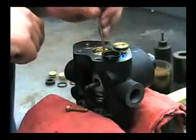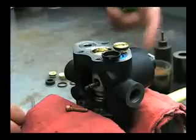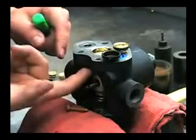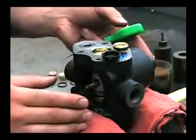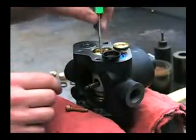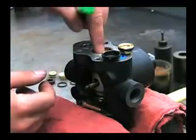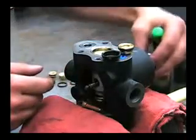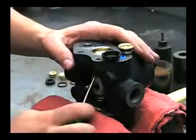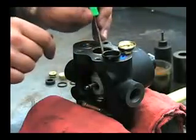If you have some difficulty getting this piece out, you can pull this grease fitting out, take this retaining ring off in front of the bearing, and push the whole bearing and shaft assembly out first. Then you'll have better access to be able to get in there and get that out. It is possible to replace the seal kit without removing the shaft, but if you have a hard time getting that out, that's one way you can do it. Another thing you can do, once the other side is out, you can turn the crankshaft back in the down position and you've got a little bit of room underneath to loosen it up. You just want to be very careful not to damage that graphite guide that sits down in there.